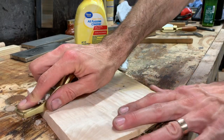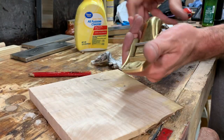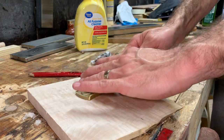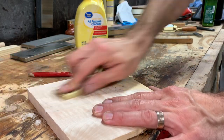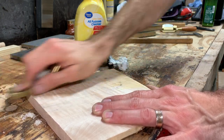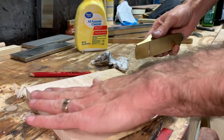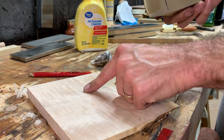Let's see if I can take out the tear out — this is some curly stuff. A little less cut than that. Of course that's not what this thing is intended for — it is a low angle plane; if anything this board should be planed with a high angle plane over a low angle plane. We get shavings, they're fairly thin. Actually that's a pretty good surface over there — and here's where I hit it before I sharpened it at all, and that's got a bunch of tear out.